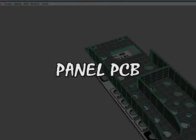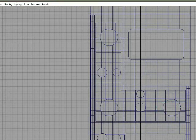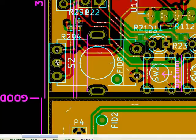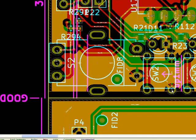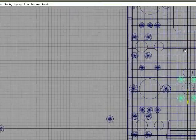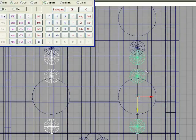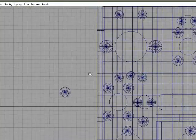The next step is to make a PC board to hold and connect the panel components to the motherboard. Once again, I am using Maya to design a PCB drilling template, but first I am making a spacer frame for the encoders. This part is always a bit tricky as one must have a rough idea of the space the motherboard will require and where to place the headers. By simply referring to previous 3.5mm jack footprints done in the PCB CAD from previous modules, I can get the offset for the jack pins and place them. LEDs and switches are easy, but getting the exact position for the OLED's pins took a fair bit of measurement and verification.